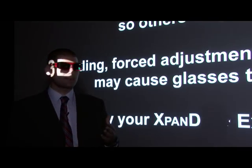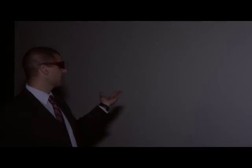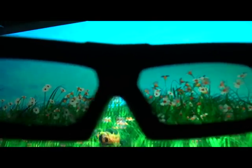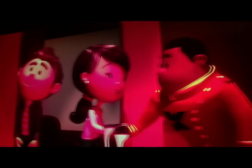With the new technology we have now with a single digital projector, those problems are simply in the past. The way 3D works with Xpand is, as you can see, there are pretty much two images on the screen — one for the left eye and one for the right eye. Our active shutter glasses are a very sophisticated electronic device that shuts one eye when the other is open, switching at a speed of 144 frames per second. That's very fast compared to the 24 frames per second that a normal movie runs at. This is our 3D system.